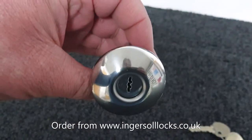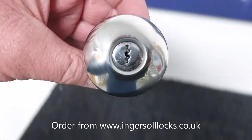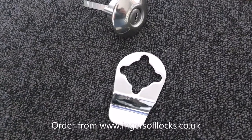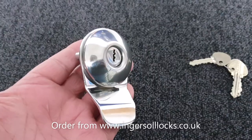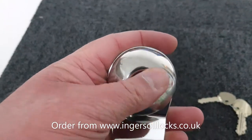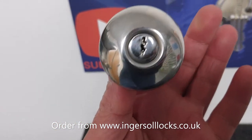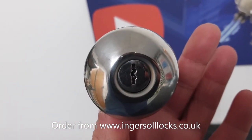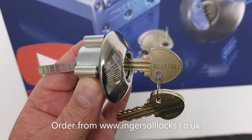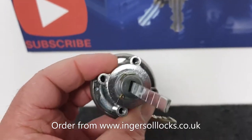sight on doors around the country, and that's what you'd be looking at most of the time. There's also an optional cylinder pull that slips over the cylinder and gives you something to pull the door shut with, which is quite useful. The classic cylinder sits in your door with the keyway vertical, and upon insertion of the key, the hole on the keyring side should be at the lowest point, nearest the ground.